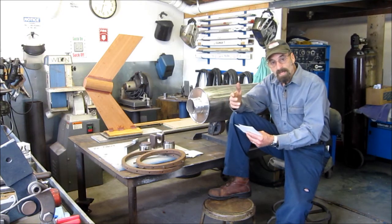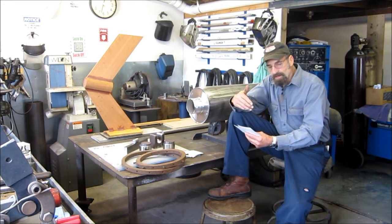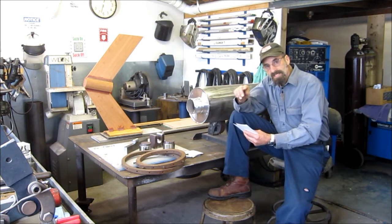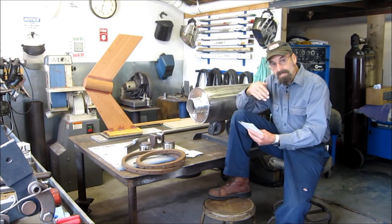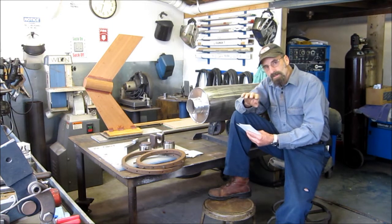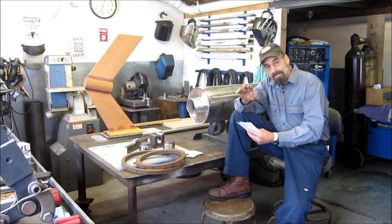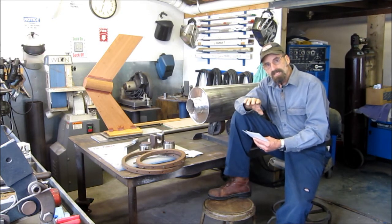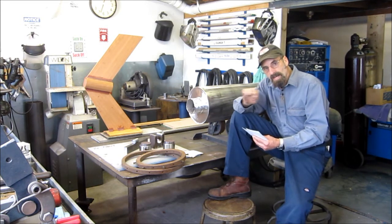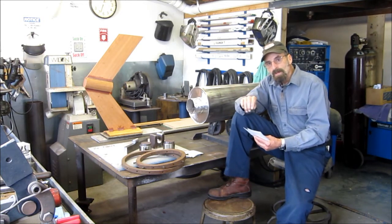Back to when the larger mast was completely cut away — halfway between these two rings you can see a section where there's studs all in a line coming out, because I made an inner ring at the proper circumference of that distance up into the taper. That was my first support and I tightened and manipulated the mast to run an indicator at that point. That was my start of actually holding the individual cut-out fingers in line and then I started to do my tag fit-up.